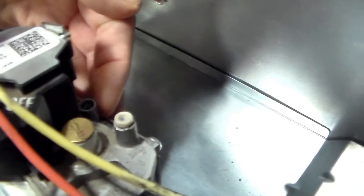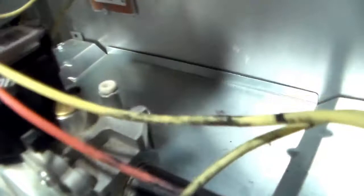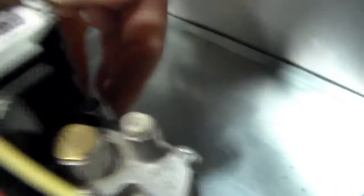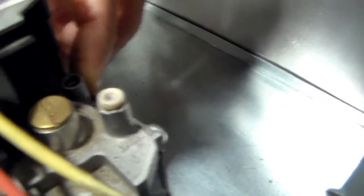Some gas valves have a big allen head screw over here on the manifold side. On this style, if you see the stubby nub on one side, you know the adjustment is back behind the solenoid. The manometer hookup is that stub — there's a little needle valve screw inside; you put your manometer hose right over that nub. Under the cap there'll be a plastic adjustment screw: in to increase, out to decrease.